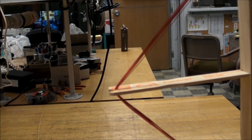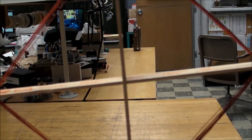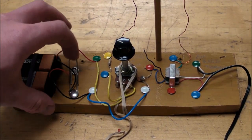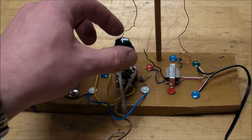There's the AM radio down at the other end of the table, and I've got it tuned to about one megahertz. The way to turn it on is to move that paper clip there, and then this 1k pot adjusts the carrier frequency.